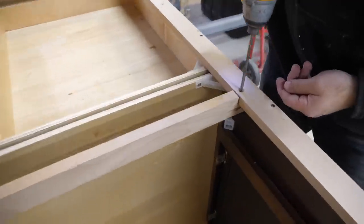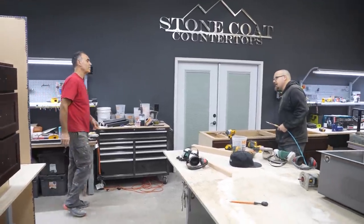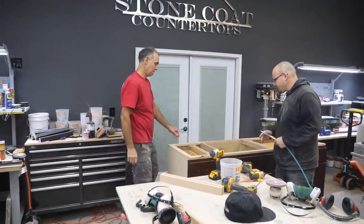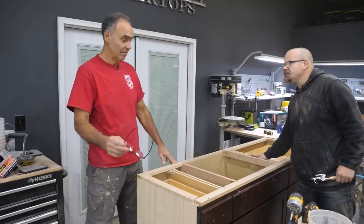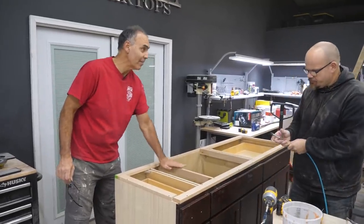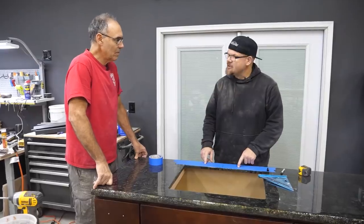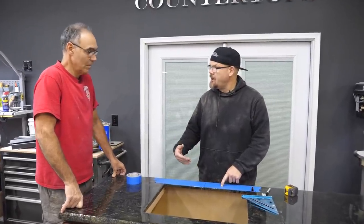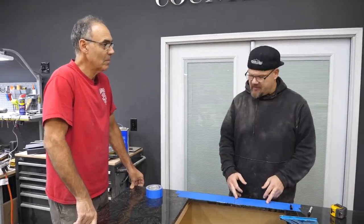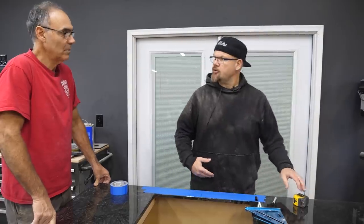That's the hard part of the install that we just did — now those brackets are super strong from being tied to the cabinet and to those screw strips. For the soap dispenser, I would go dominant hand — for most people, right hand — and I go eight inches so I don't just hug in here, it looks funny. I'll usually go eight inches to the right.